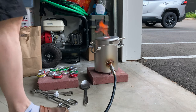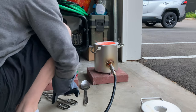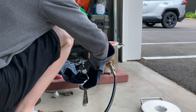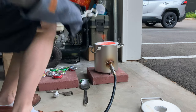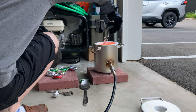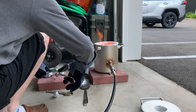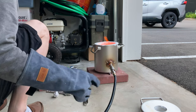And this is the setup. I've got two insulating bricks to protect the garage floor. You're going to see me sequentially load using these heavy duty stainless steel tongs. We're going to load recycled aluminum beverage cans of different kinds that Meg and I collect from the LaCroix drinks we drink and from people we work with — our friends, family, and co-workers. You see the process of loading the cans into the forge, which is followed by an incandescent orange-red flame coming out. That's because the fuel-air mixture richens up as flammable components painted onto the can for the label actually boil off and become part of the combustion.